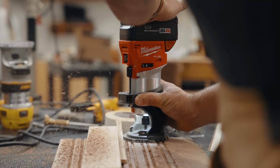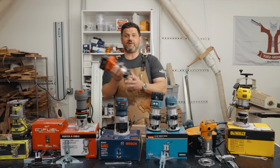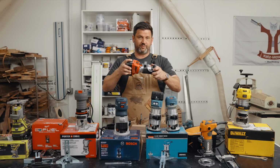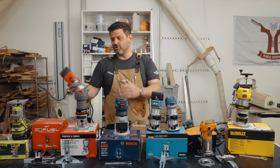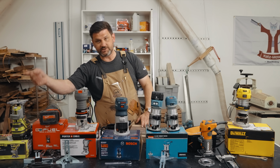It looks very nicely built, comes with great accessories, but it's got 0.04 of play in the mechanism, and you can adjust it when it's closed, which a router shouldn't do. And then the Ryobi, we're not even going to let it continue the test because it can't hold the bit.